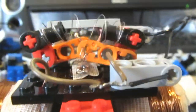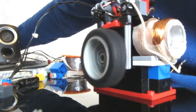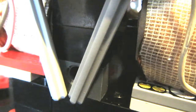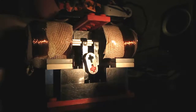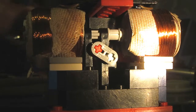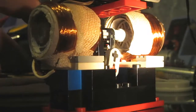Well, I'd say that's running pretty damn well — except it doesn't anymore. Something weird is happening: the engine won't run at all now. It's a bit hard to see, but the two vertical pieces I used to wrap around the camshaft have actually been pushed apart due to the force of the cylinders. I'll need to find a solution, otherwise this engine won't run for very long. Both cylinders push inwards, so if I put a few Lego pieces between the cylinders and the vertical pieces they'll always be pushed into place.